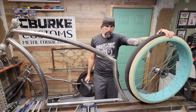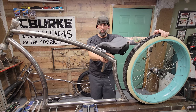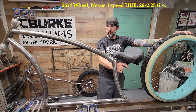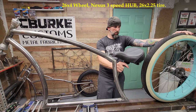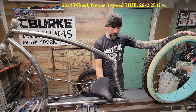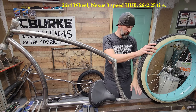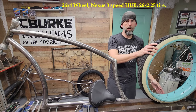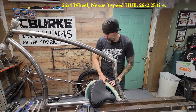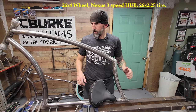What really determines where you're going to put your seat is where you're going to put your wheel. If you want your wheel running nice and close you can't put your seat there. I wanted this one to be a little longer, so I want to run the seat off-center, which pulls the wheel back more. I draw a line on the jig from the center point down so I know where to mount the bracketry for the dropouts.